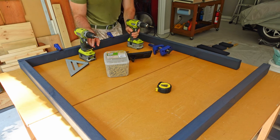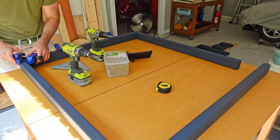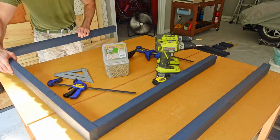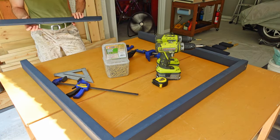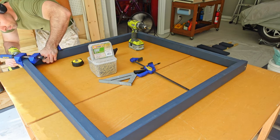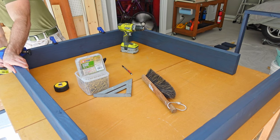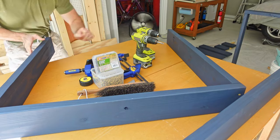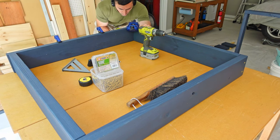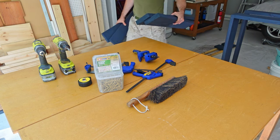I'm starting assembly with the two by threes. The boxes are basically four levels of wood stacked on top of each other. Level one uses two by threes — two 36-inch boards and two 39-inch boards — making an overall 39 by 39 inch square. Level two uses two by sixes. Levels three and four each make a rectangle sitting on the level below. Level three uses two by sixes — two at 36 inches and two at 24 inches. Level four also uses two by sixes — two at 36 inches and two at 9 inches.